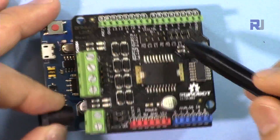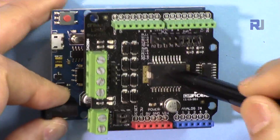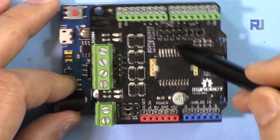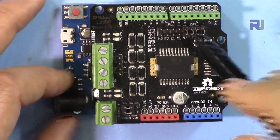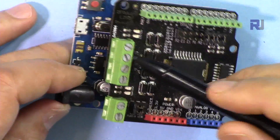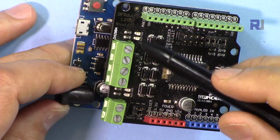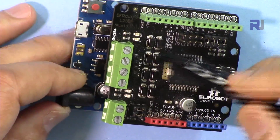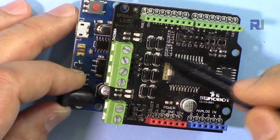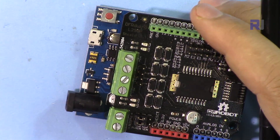These connectors are misleadingly labeled as PLL — there is no PLL hardware here, in software, or in the code I've provided, and the manufacturer's website confirms nothing exists for it. Because DC motors are bidirectional, you need a freewheeling bridge rectifier to protect the device. This shield has four Schottky diodes for motor B and four for motor A, so you don't need to connect external diodes across your motors.